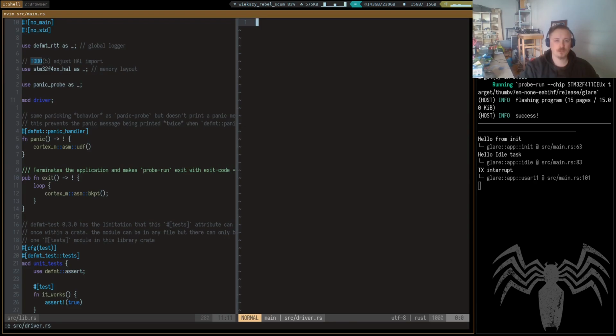Because we do want to use an interrupt for the communication, at least for the receive side, because at least initially, I think the way it's going to work is that we will basically poll the camera for the frame, and each frame is going to be just a bunch of bytes in the buffer, and then once we have this full frame we want to send it to the remote device.